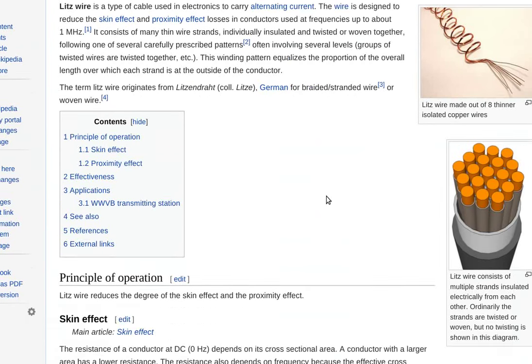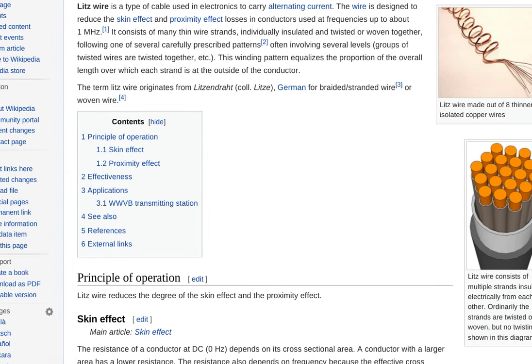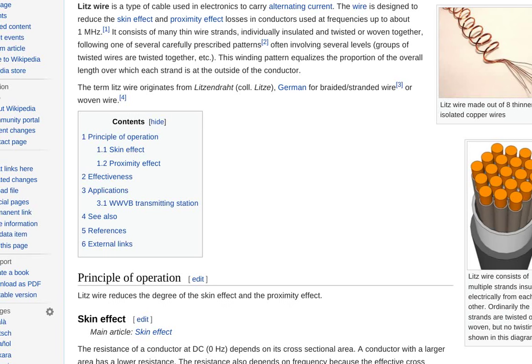So welding cables are typically four gauge. Yeah, this is very fat. Four aught, like 0000, is like house wire, power from the street? Power from the street is usually smaller than that. Yeah, and after the transformer on the house, we've got four aught aluminum cable to our house here. Okay. So Litz wire is basically multiple strands inside a strand, and each strand is insulated from its neighbors, unlike regular wire.